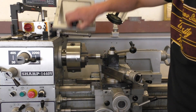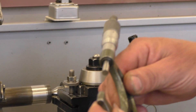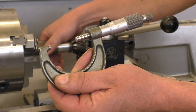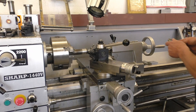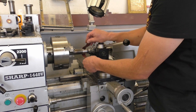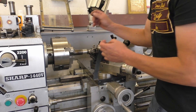Now we should be to size — close enough to where we can sandpaper it in. Right now I am two thousandths under, so I'm one thousandth under what the original shaft is, which is okay. The bearing will still ride on there and everything will be just fine. So this is complete right where it's at. If it was just a little bit over, what I would do is take just a little piece of sandpaper and come under here and just sand it a little bit. You want to be careful not to wrap it because it will suck your hands right into the shaft — always make sure you're just touching the bottom of it like this. And that's the completion of the project. Thanks for watching.